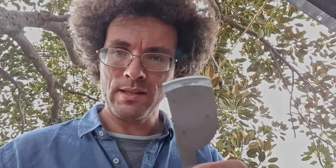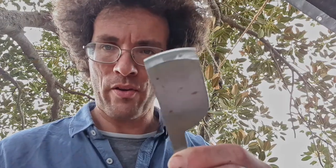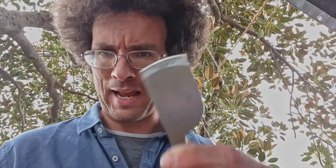So I thought I better grind the bevel back a little bit more, and went back to the rough sharpening stone. And then as I kept on grinding and grinding on the rough stone, this is what happened — almost perfect camber to the blade. And that camber is there because of the camber of the whole body of the blade. You can't really see it, but it's there. And as I've ground the bevel, I've ended up with this beautifully even cambered edge.